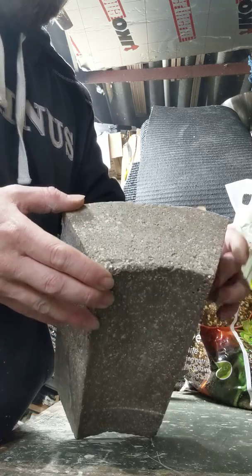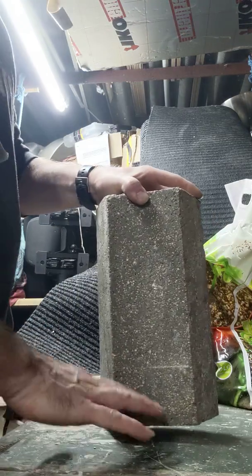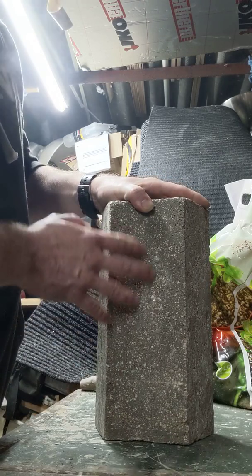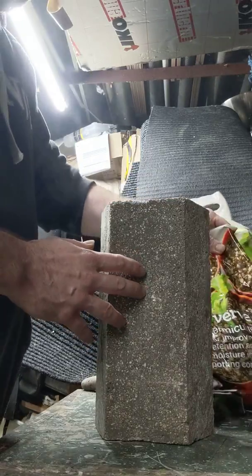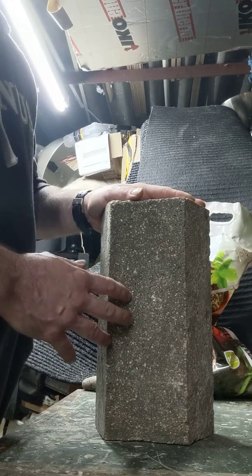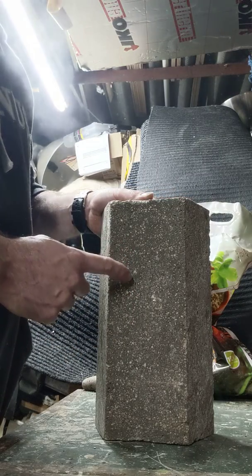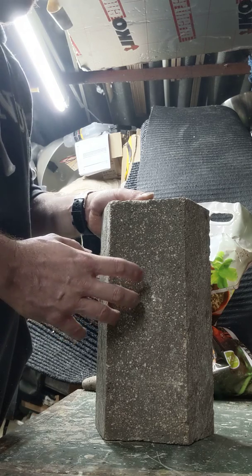They were put together with fire cement, and then they will be sat on a base that is made of the same stuff as this. This is just a vermiculite mix, cement and play sand. This is quite a dense mix, and I've got 4 more to make, so I might be making these a little bit lighter, I'm not sure yet.